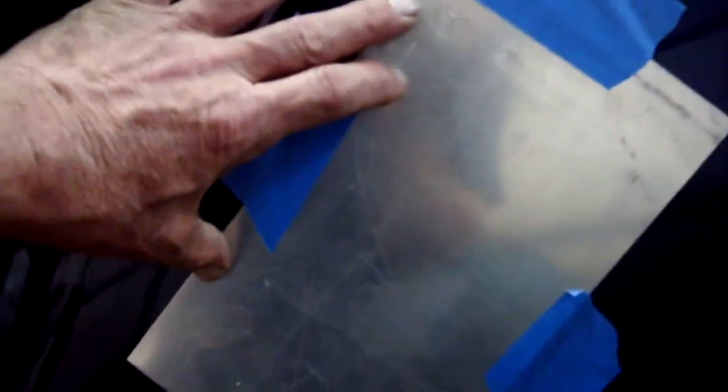We've taken a piece of aluminum the same thickness as the cowling and taped it to the outside, so we can come along on the inside, press it firm, and score it with a scribe. We're going to cut this out a little oversized, then slowly sand it down until it's a perfect fit in the hole. Then we'll cut a doubler ring larger than the patch, fix the patch to the doubler ring so we have a nice flush patch on the outside. Then we'll cut a hole at the bottom — we've already made a template for that.